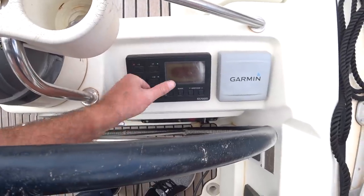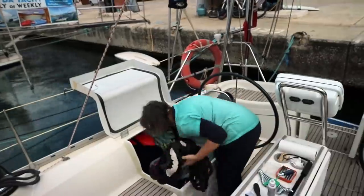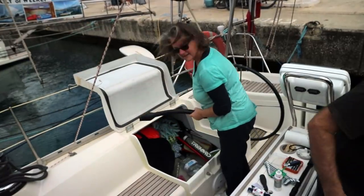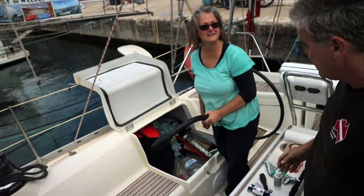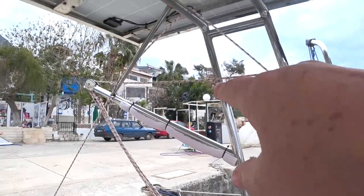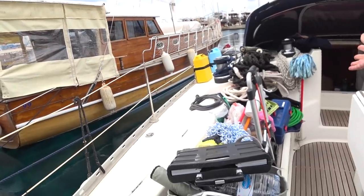While we're on a roll, we're now going to attempt to remove the autohelm, which means we've got to empty the starboard lazarette in the cockpit of all the stuff. Then I've got to get in that cockpit and come up underneath the helm position and undo the holding bolts, nuts and whatever in the back of the autopilot to release it. At least that's what we think — there's no other visual access that we can see. On first inspection, it looks like we might be on the right path here.